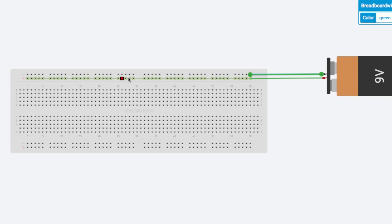This row here is all nine volts — positive DC voltage. If you're using op-amps, or if you need power on the other side of the board, it's easier to pull power or ground from there as well. So a lot of times we'll create a jumper going from one positive side to the other, and same thing with ground. So now this row is positive and this row is negative on both sides of the breadboard.